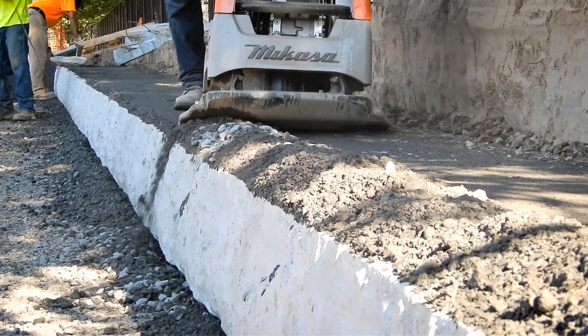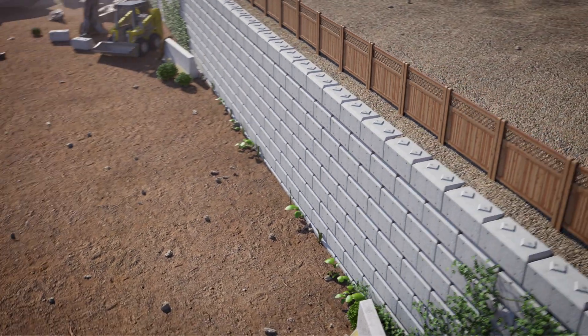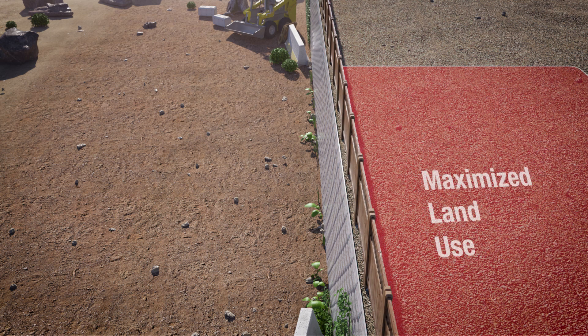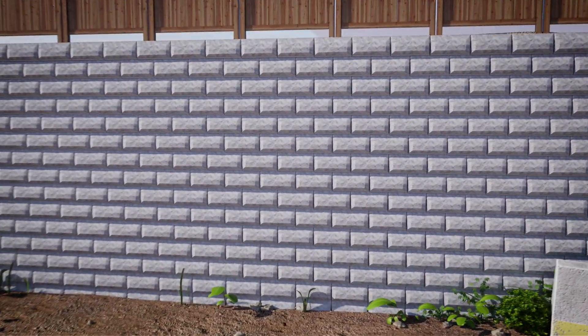And because the Lock and Load cantilever unit uses the soil weight of the backfill to create the stabilized soil mass, the concrete face can be thin, which allows for maximizing land use. No wasted space building fences or buildings farther back than necessary. In some cases, land developers get several additional parking spots or maybe even an additional building lot.